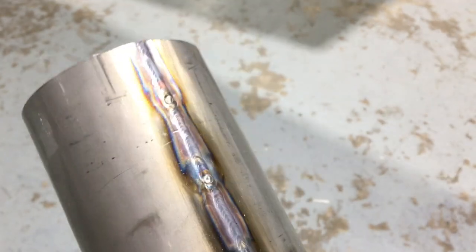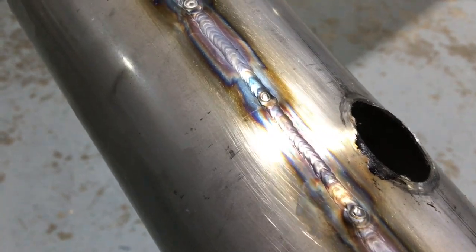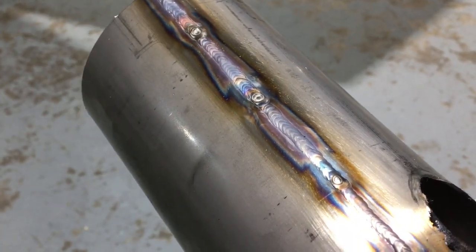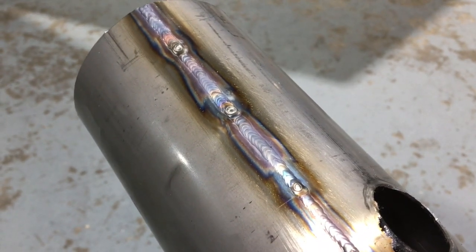There's a shot of the inside. On that last couple of inches towards the end I got a little bit slow — it's penetrated slightly more than I would have liked. I would have also liked a slightly better purge, but you can't have everything. And there's the outside. It is not perfect, but it's not a grey festering mess — we've got colours. We've managed to keep the distortion pretty much to a minimum. I always want my welds to be neater, I try and make every one better than the last. This will do adequate. Thanks for watching. Good night.